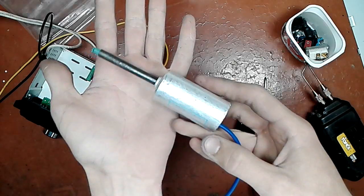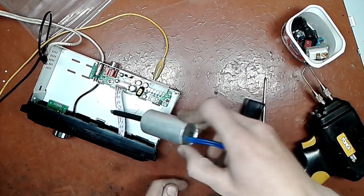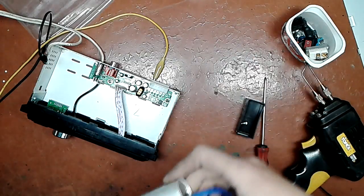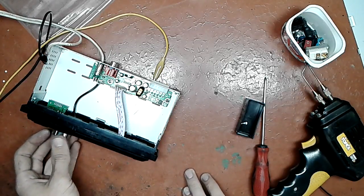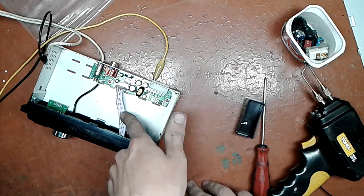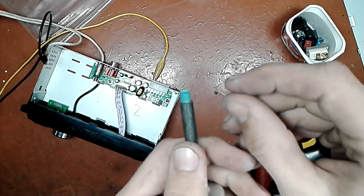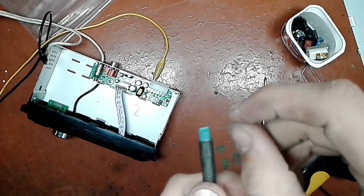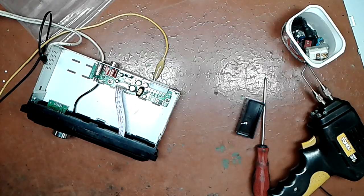This device is very useful and allows me to sniff the presence of audio in the ribbon cables, no problem. I had to crank up the volume all the way though, but that is perfectly fine, because this ribbon cable carries a line output level signal, which is not that large. And being able to sniff it without contact, just by capacitive coupling that is coupled to this little exposed piece of coax, is very, very fascinating.